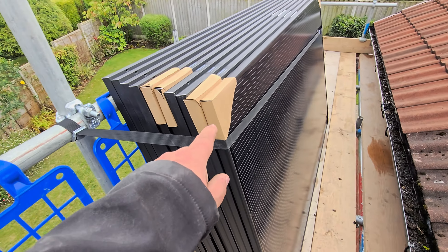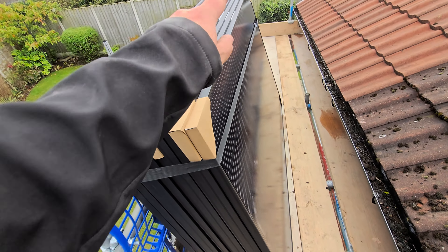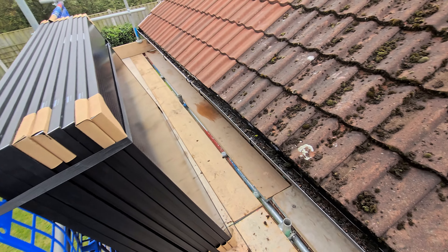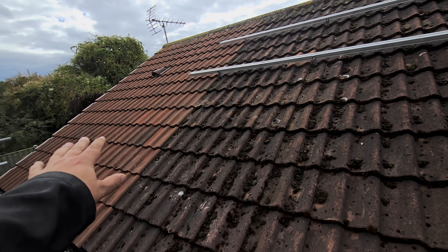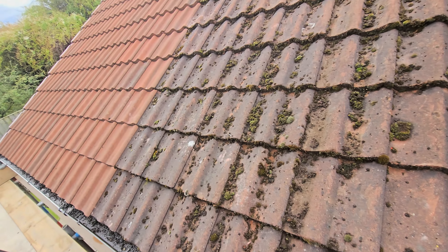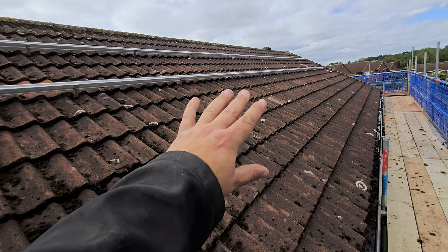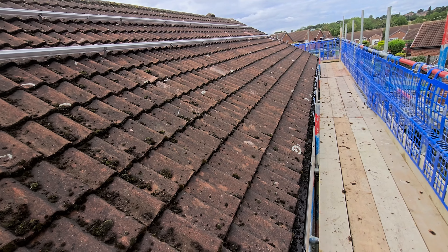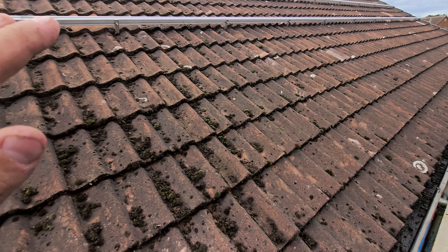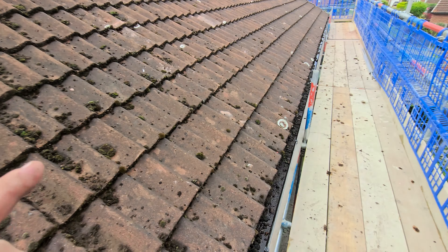There's quite a lot of moss in this one — the gutters are really dirty so I'll get the guys to give that a scoop out before we go. These are the Trina bifacial panels — I'll show you those at the other side and see if we can find a data label on the back. We've not put any panels on that little extension — not for any structural reason, just because we're trying to keep the array as far that way as we can on this side due to the northeast aspect, just to try and make it cling on to the sun as much as possible. The other side is because of shading from the neighbouring property.